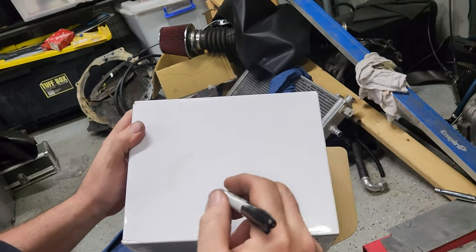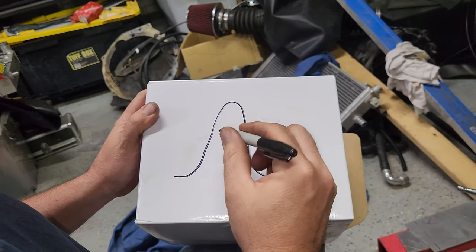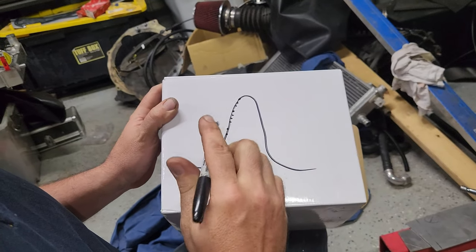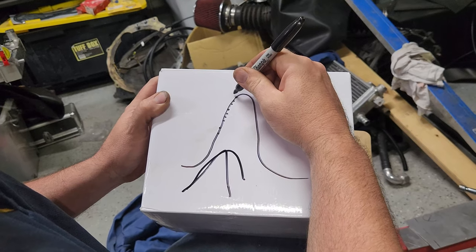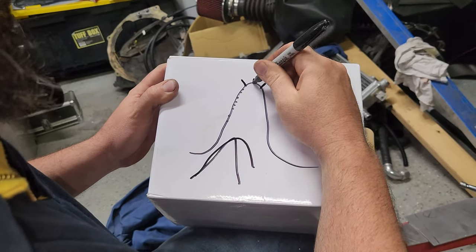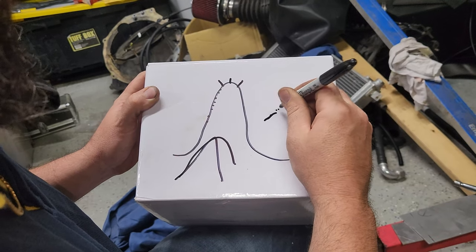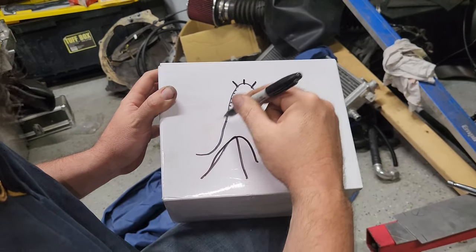What we've done is — this is basically like a sine wave type thing. When the piston comes up to the top it floats at the top for a bit and then comes back down again. Because everything's circular and elliptical, nothing has a precise point — it's always a range. So we marked the first position there and the second on the opposite end, then measured to find true top dead center right on top. You can do the same thing with a dial gauge, but we can't access the top of the piston in this setup, so this achieves the same result.